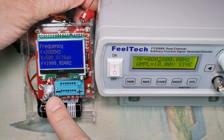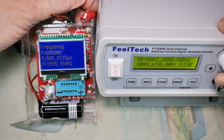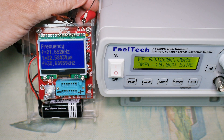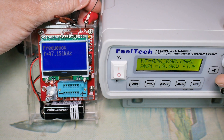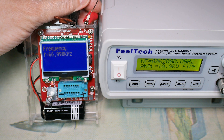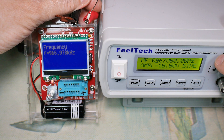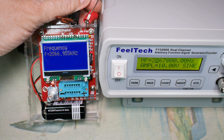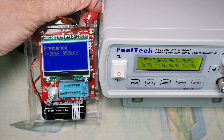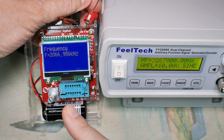I've got this now in frequency counter mode and I'm feeding it from my signal generator over here — you can see it compares pretty nicely: 2000 Hz and 2000 Hz. Let's crank it up to say 32,000 Hz. It's a little bit slow to respond, but this is doing a nice job. 66,998 — that's reasonable. Let's crank it up in bigger numbers — still looking pretty good. 20 megahertz. So frequency counter mode seems to work pretty well. It's a little bit slow, but if you want a frequency counter and you don't have a lot of money, this is a great tester.